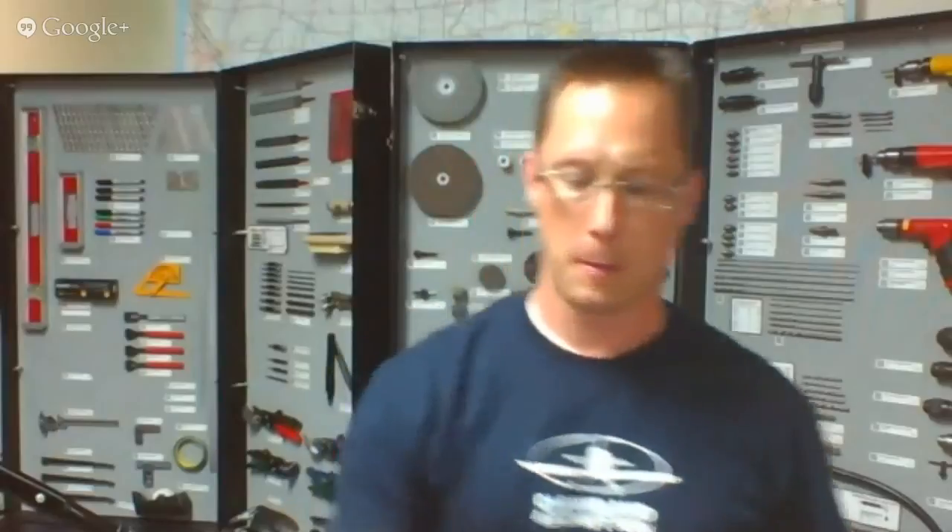There's a photo that was posted — it looks like sample dimples done on a piece of aluminum with varying degrees of pressure. The far outer ring is very significantly present on it. Looking at it, it looks like too much pressure because it's doing that in general, and it almost looks like the dies are contacting on the outside surfaces first instead of the inside.